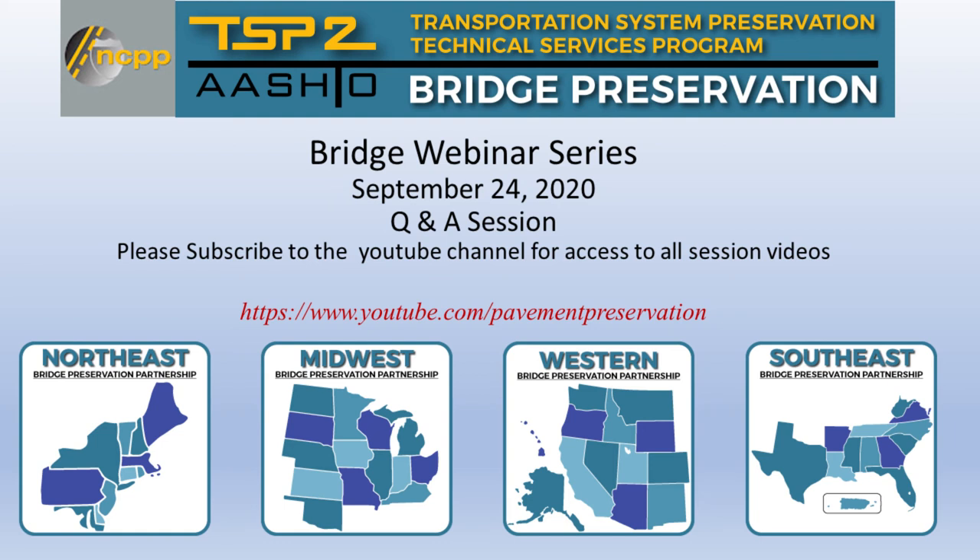The biggest thing would be trying to make sure that you're not too out of line with concrete with whatever material you're putting on. That was a big reason we were interested in visiting the PPC bridge a year after it had been in service — we figured that was one of our initial concerns with PPC. Is the difference in coefficient of thermal expansion going to be enough to result in cracking? We were happy that there hadn't been any, and from what we saw, there wasn't really any indication of separation.